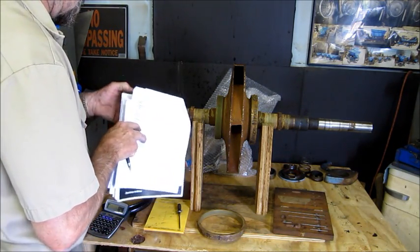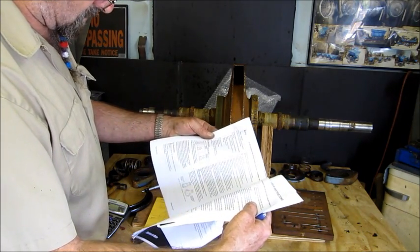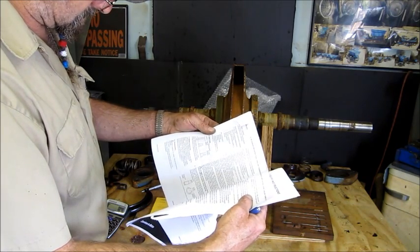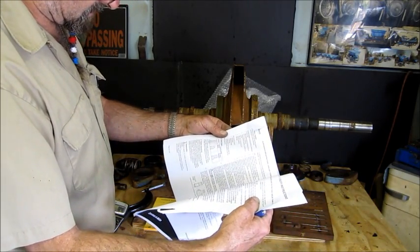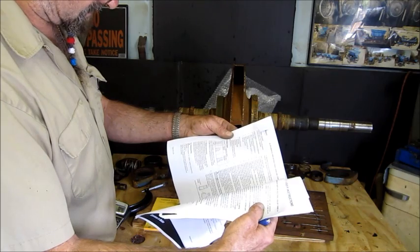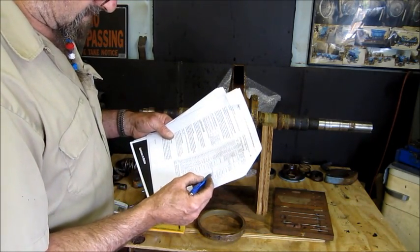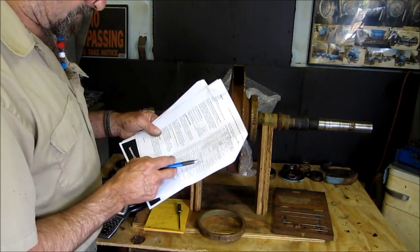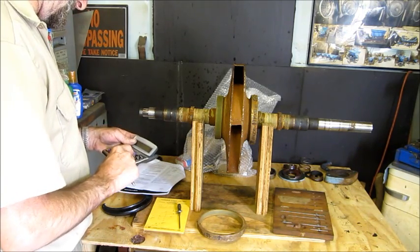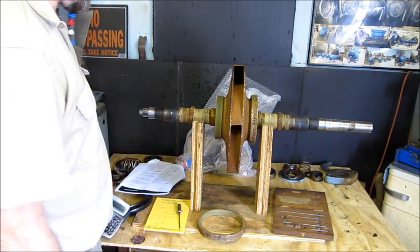Okay, in the recommended manual here, it states that as wear takes place between the impeller ring and casing ring, the overall efficiency of the pump will decrease. Radial clearance detailed in section 3.4.2 has doubled. To maintain optimum efficiency, it is recommended that rings be replaced and the impeller renovated when the radial clearance detailed in section 3.4.2 has doubled. And in that figure, 3.4.2, we got 9 thousandths for this pump. This is a 5LR15, 15-inch pump. And that's 9 thousandths, so a double is 18. So if we took 48 and divided by 18, it's basically 2.6 times worn out.